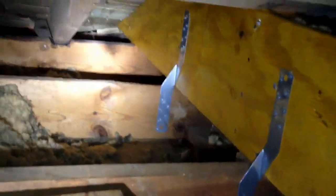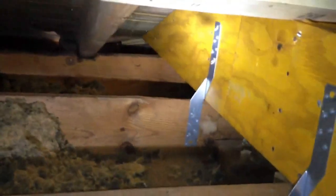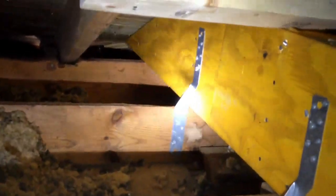You want to make sure that you have proper bearing. So what we'll have to do is come on the inside of that and come to this joist and install blocking and studs down so that you have enough bearing at the end of the beam — enough meat at the end of the beam to properly transfer it down to the foundation.